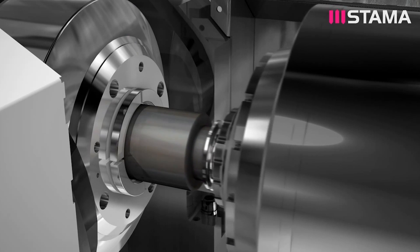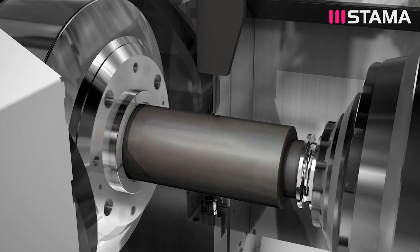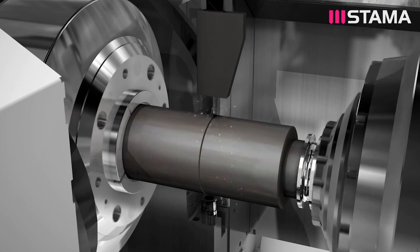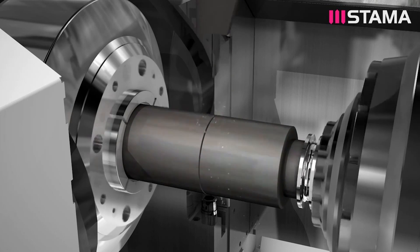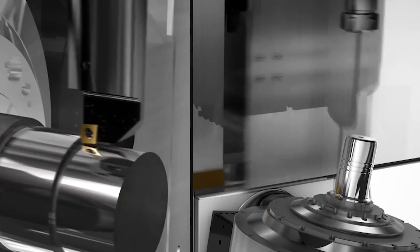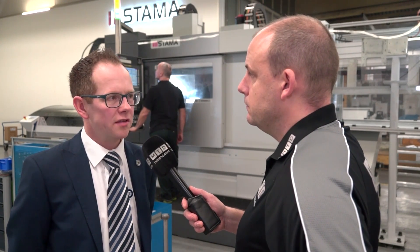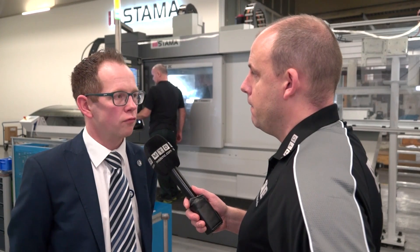On both spindles on both sides? On both spindles, yes. This machine is very split — you've got one machining cell and a secondary machining cell. That's right, two independent columns giving you two independent milling spindles, so you can do Op 10 using your left-hand milling spindle with your left-hand turning spindle, and then Op 20 using the right-hand milling and turning spindles.